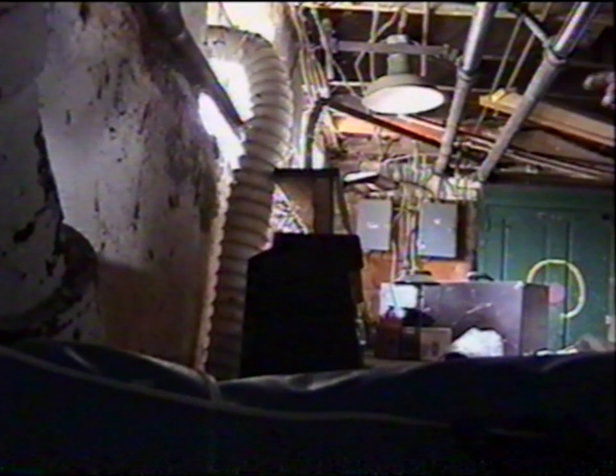These pipes, first of all, someone's going to have to evaluate where that goes. But let's say I don't even know where they go. If the kitchen sink and the dishwasher drain into this, that's exactly what's supposed to be. And then what you do is you take your sump pit and you just pump it to the outside, just above ground. You need to get this to be pumped to the sewer pipe. That's the imperative.